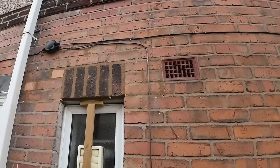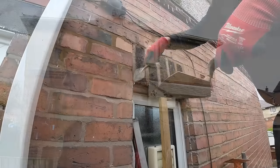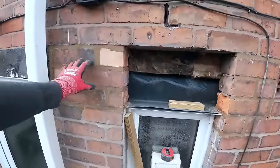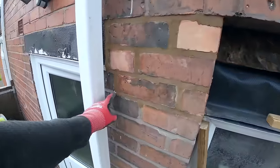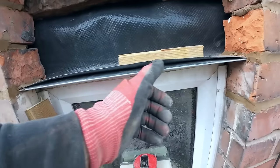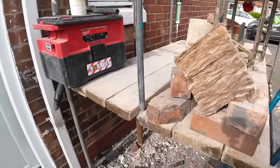There it is. A lintel on this job that didn't take us till night time. That's a win in my book. Yeah, almost finished, it's not night time. There you go. Sides are in. Upstand and vents are in. Trays in. And as you can see, no matter how even that short span, it's still got a bounce in the lintel. There's our insulation. It's actually 150 that. But we're going to split it down.